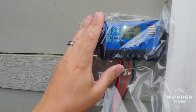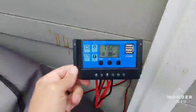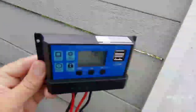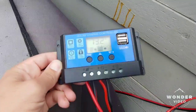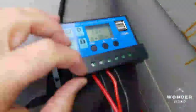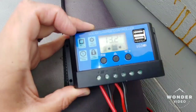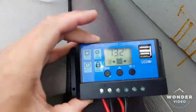The reason you need the solar controller is to regulate the voltage going to the batteries. The generated solar power from the panel goes into here. We got some rain here in Southern California — first time in about a year — so I put it in a bag. I'm not sure if it needs to be waterproof or not. It's a pretty simple, cheap $30 controller. You can see the wiring coming from the panel and the wire going out to the batteries. You can control lights or your pump on this side, but I just went straight to the batteries. You can see it shows the batteries are full, charging at 13.2 volts directly from the sun.